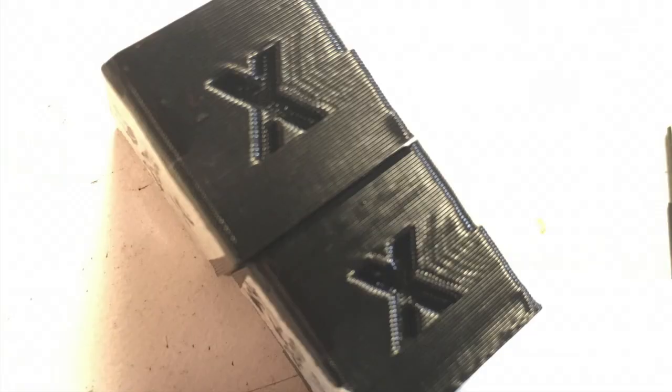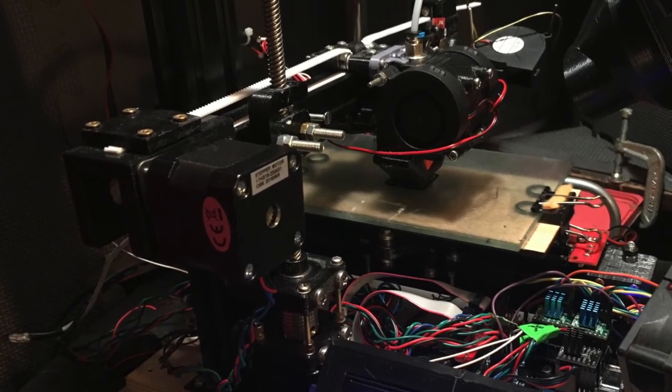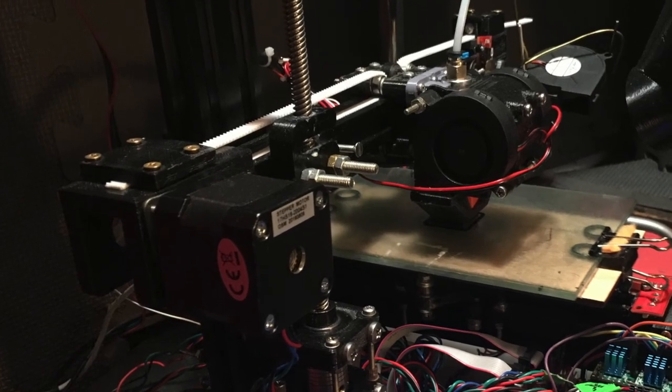As you can see from this print it looks practically identical — the bottom is polyurethane and the top is standard neoprene. I had high hopes and I ended up just annoyed, especially since it's not easy to change the belt on my printer. The belt starts at one end, goes around bearings, under the pulley, all the way across the bottom, around the other bearings, and then clamps. But since I printed all these cubes I could at least pull out some data on what the jerk, speed, and acceleration settings do for ringing.